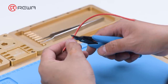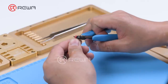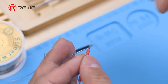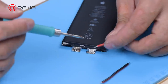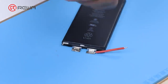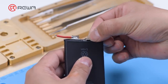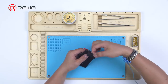Get a red wire and a black wire. Use a cutting nipper to strip each end of the wire to expose the copper wire. Apply tin on the copper wire with a soldering iron at 365 degrees Celsius. Solder the red wire to the battery anode and the black wire to the battery cathode. Press the anode and cathode connections, then apply insulation tape.